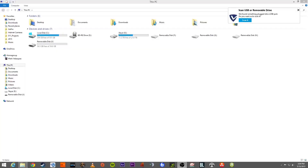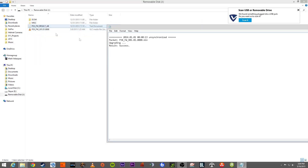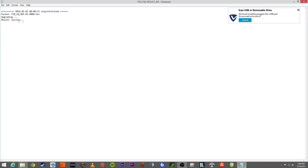To confirm the firmware update installed correctly, take the microSD card out of the Phantom, put it back in the USB converter, and open up the card on your computer. You'll find a text file in there, and if you open it up it should say 'success' or 'failure.' If it says success, you've done everything right and your Phantom is all up to date.